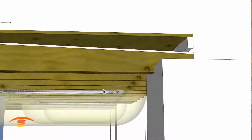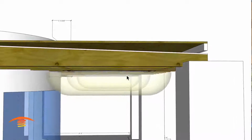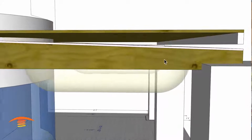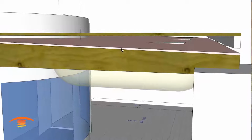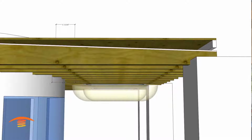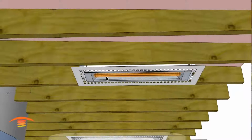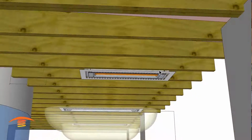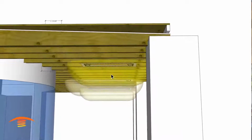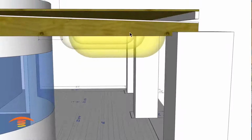So we could bring the heater down and add an additional layer of the ceiling so that the heater ends up being slightly lower and the ceiling is actually slightly lower. Or I'm not sure about being able to reduce this angle. I don't think that'll be enough. Or we could simply take that one unit out and put in the WD model, which is the dual element unit. And that WD has a smaller frame, obviously, and you can see that we're meeting our clearances with that. And then moving all 3 heaters further inside so that we meet that need over here.